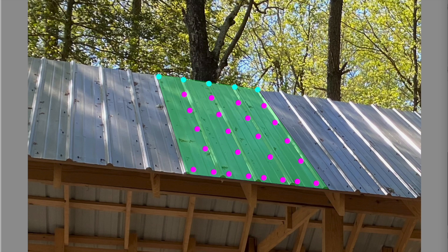That's the general screw pattern recommended by ABC Metal Roofing for these panel types — screws down in the valleys. I've done that for years and never had any issues. I like to follow the manufacturer's guidelines because they know what they're doing, and if there's ever a warranty issue they need to be happy with how I installed the panel before granting coverage.